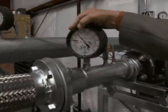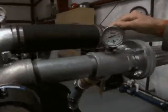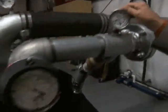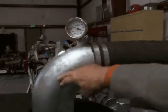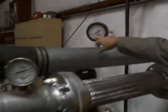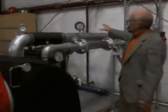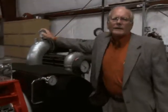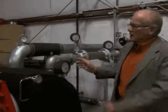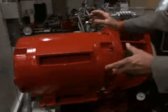We're running at 70 PSI on the inlet side and 180 degrees on the temperature. As we go through the machine, it drops to 18 degrees — 17 degrees coming out of the exit — and the pressure is running about 2 pounds on the other side. So we're going from 70 pounds to 2 pounds, and from 185 to 18 degrees in a microsecond. All that energy is going into the generator to generate clean, green energy out of waste.